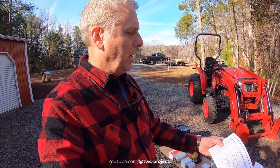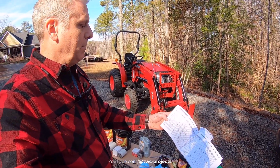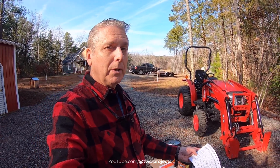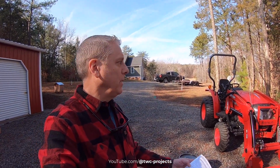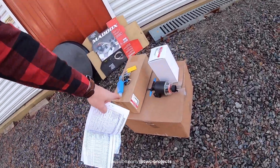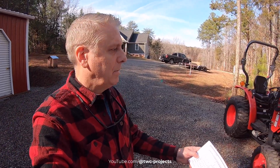Also we're going to go through and check some things, and there's a whole listing. I'll try to put it up on the screen as well when I edit this video. The main things we're going to check are all our grease fittings. We're going to just grease anything that needs to be greased, quite frankly. We'll check our coolant level, see how that looks. We don't need to change the coolant today. We're going to clean the air filter out. Don't need to replace that. And that's one of the mistakes I made when I ordered the 50-hour kit. I'll tell you what, it came with a full air filter and a fuel filter, which you don't need for a 50-hour. But I have it now. Rookie mistake, spent a little extra money, but at least I have it.